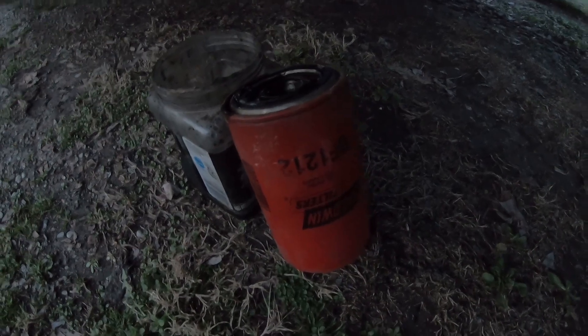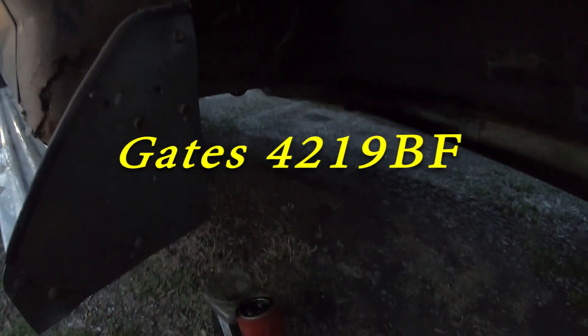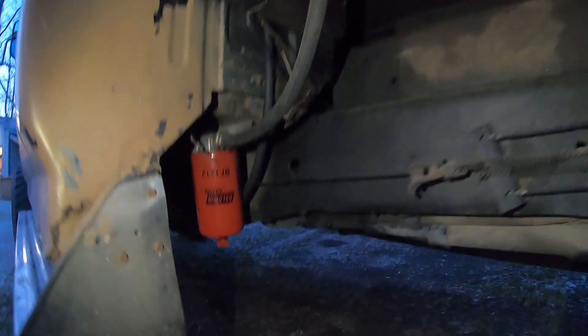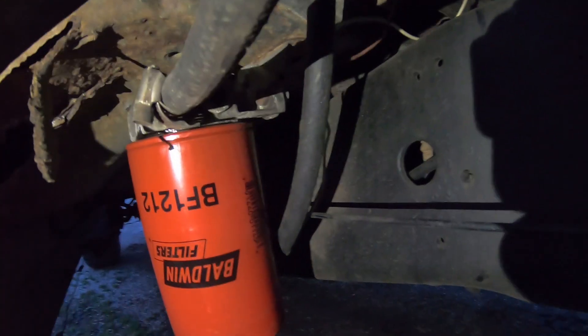Got the old filter drained and dropped off, so we're going to throw our new one on there. Be sure there's a center o-ring — you can't see it because it's dark under here — but there's a center o-ring that seals this stud as well, so be sure to replace that on these Wix filter heads. This is just a Wix filter head with half-inch B100-rated fuel hose. It's been on here four or five years and it's not starting to seep oil like normal fuel hose typically does — I think it's made by Gates, and I'll look up the part number and post it. New filter on, turn the valve on, and check for leaks — looks good.